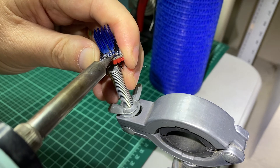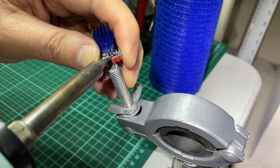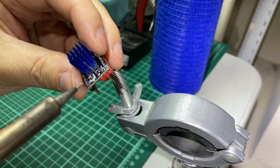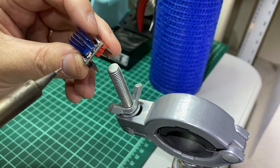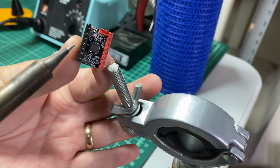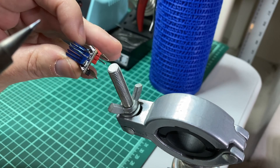The reason I'm going slow is I don't want to fry the board — I don't want so much heat that other solder points get melted. I like to apply a little heat at a time and just keep pushing firmly until it moves on its own. There you go — from this side you can see the pin has been totally removed, and the pin is right here. I can just push it back in if I want.